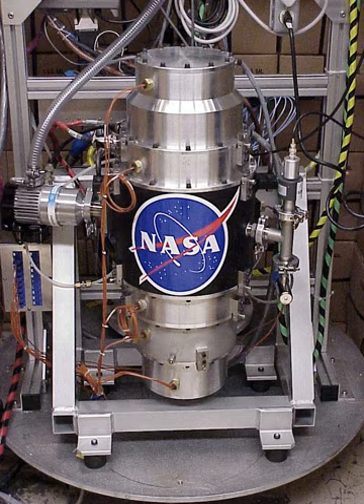The NASA G-2 flywheel was a design funded by NASA's Glenn Research Center and intended for component testing in a laboratory environment. It used a carbon fiber rim with a titanium hub designed to spin at 60,000 rpm, mounted on magnetic bearings. Weight was limited to 250 pounds; storage was 525 watt-hours and could be charged or discharged at 1 kilowatt. The working model ran at 41,000 rpm on September 2, 2004.